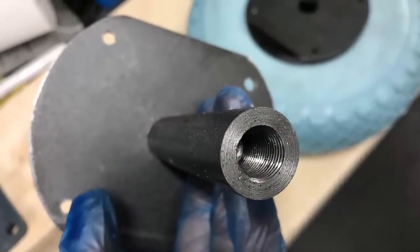The powerful electric drills in the system here, as with most corded drills, the chuck is, what do you call it, tapered. It's threaded onto the output shaft from the gearbox on the drill with a half inch fine thread, I think it is. So I simply threaded the drive shaft of each wheel with that half inch thread and secured it with, it's not Loctite, but it's a threadlock, and I thought that actually just might hold because threadlock is really a strong bond,